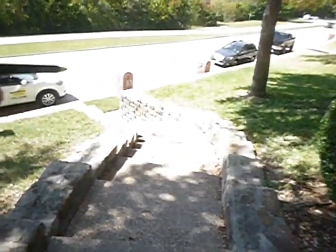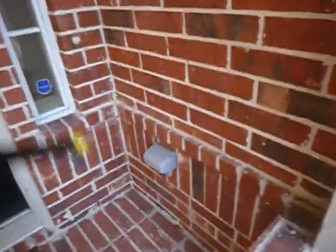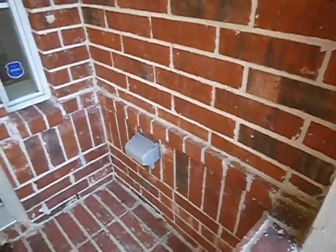There's a little bit of movement on the front walkway. Four or more steps should have a handrail. I haven't seen the garage yet, so I have not checked the GFCI, but there is power there. We have our weep holes here, but we don't have our weep holes up here — just like before.